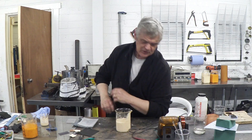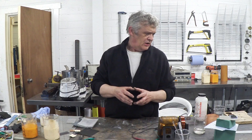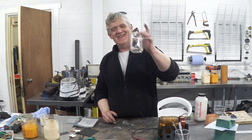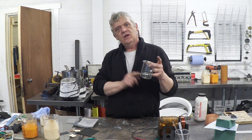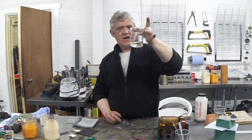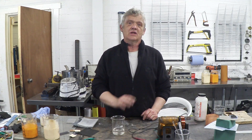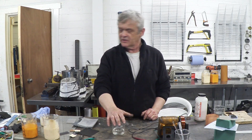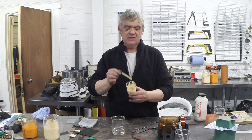Making solar cells is actually stunningly easy once you get that paste. When we get that paste we want a glue to hold everything together, and the really good glue is this — a 40% solution of water glass. You get some sodium silicate, 40 grams of it, put it into 60 milliliters of water and dissolve it. So it's 40 by weight sodium silicate in water, or water glass. That stuff is a glue that will glue metal oxides to glass and to metals like you wouldn't believe. You mix it up with the yellow lead until it's a paste.